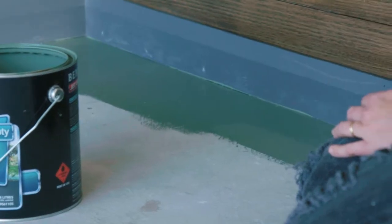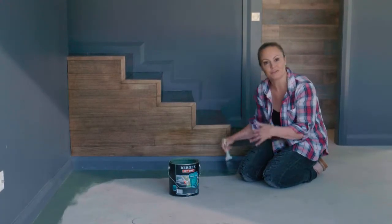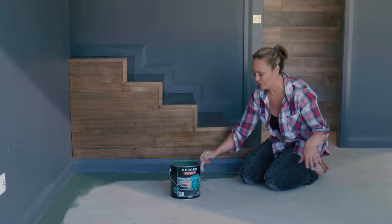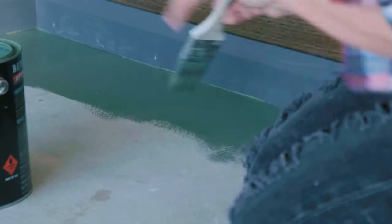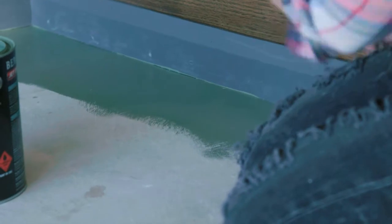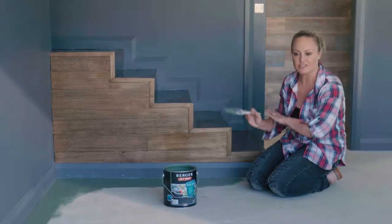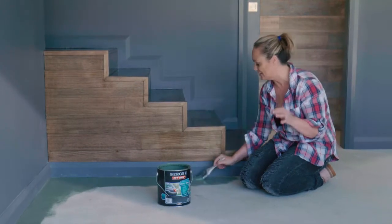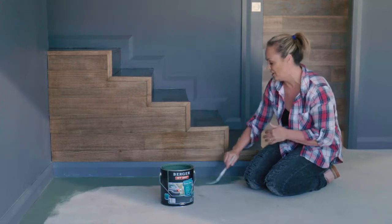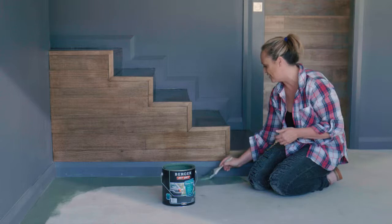This paint is just going down so well, and it should — we did the correct preparation yesterday. We followed the rules and acid etched the whole area, then once that was dried and cleared off we sanded it lightly, then went over with a really good vacuum cleaner to suck up every last bit of dust and micro hairs that can get caught in paint. We were left with a beautiful clean surface and it's working a treat.